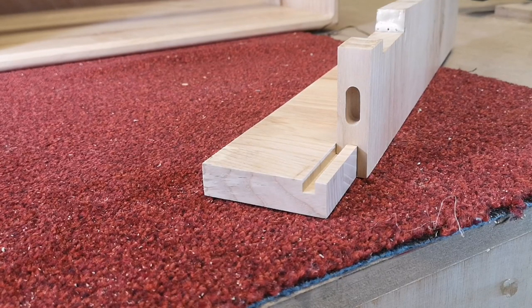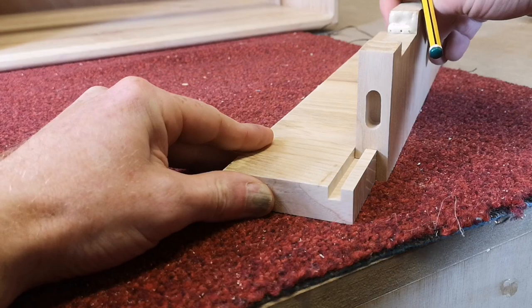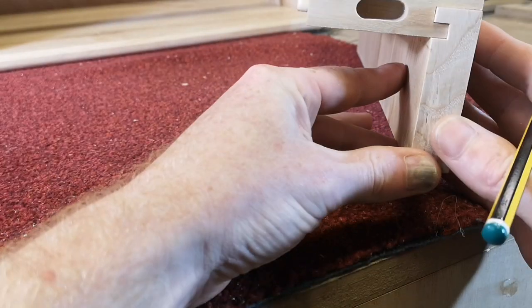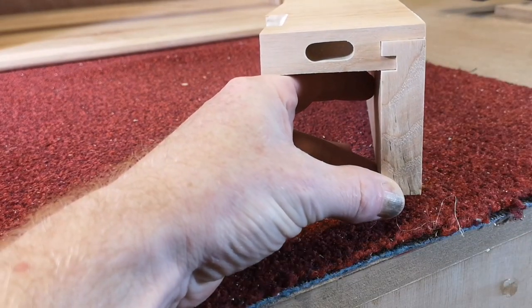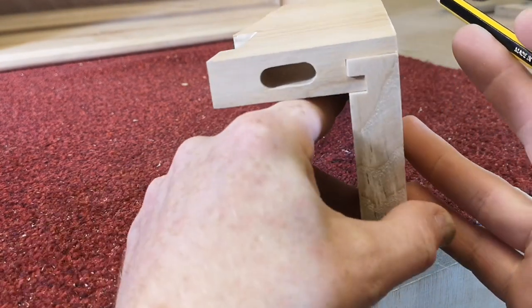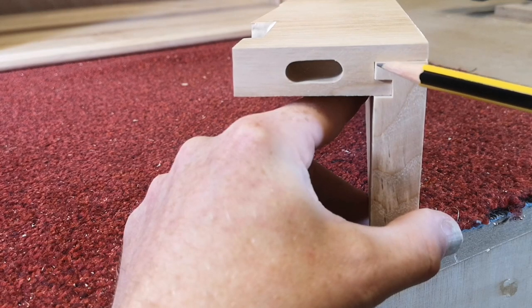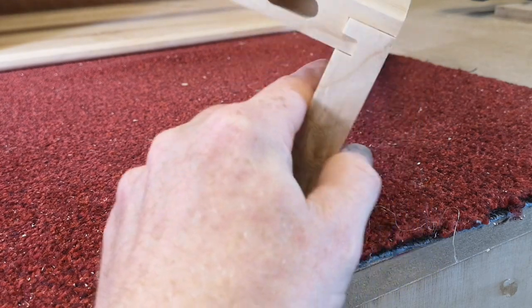So, here is the joinery that I used on the carcass. It is called a half-blind, half-lock joint. As they slide together nicely. So, I chose to use 18mm for my carcass thickness. So then when I did this joint, it would end up nice and even with a 6mm piece, a little 6mm tenon, and another 6mm tenon below.